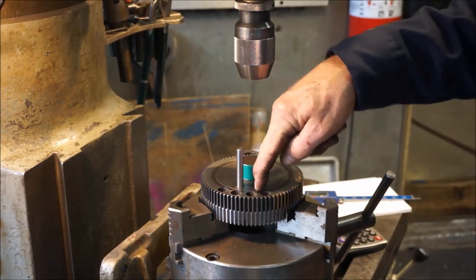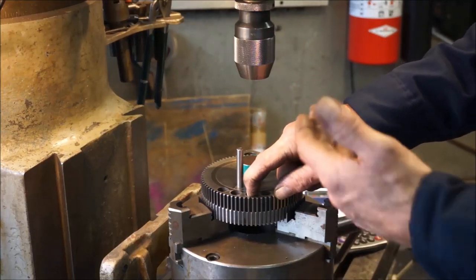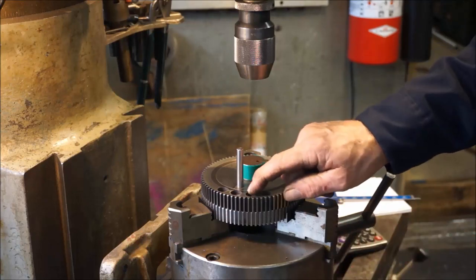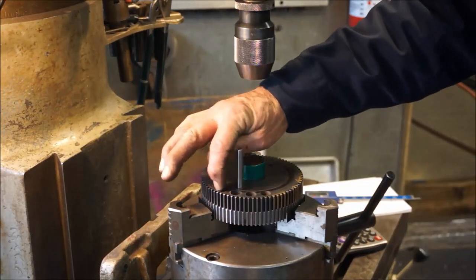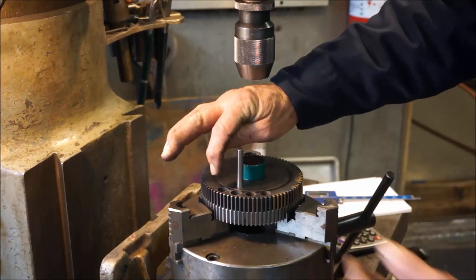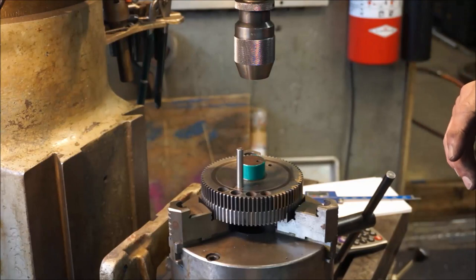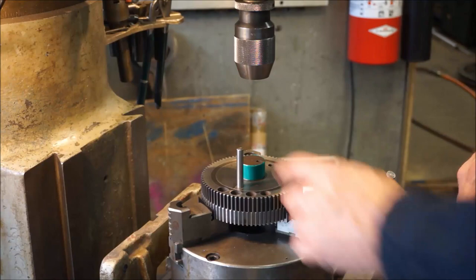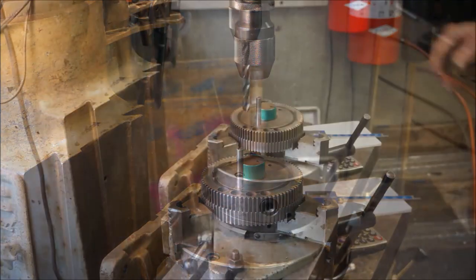All right, we're gonna go grab a drill and then we're gonna come over and put the drill point down on here and then put the drill point down inside there and read our depth of what we're gonna be in difference there. So we'll probably come over and line up on this one here first because then we can come just directly south of that and touch that surface and then come back into our zero point once we locate it and we know what number X and Y location we are there, and we'll be able to gauge the depth and then we'll just go one at a time right on over.